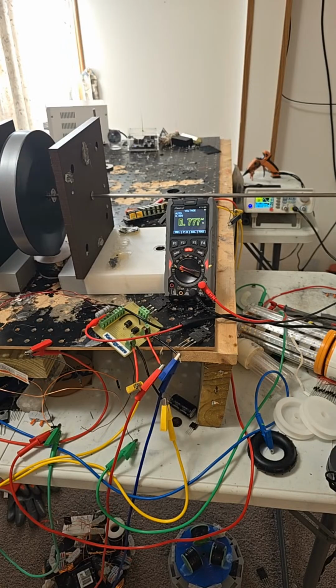All right. So, to set up the closed loop system, I think this wheel will work for it. Whatever we do, the wheel will work fine. With this coil at voltage, you want it to be between zero point three and zero point one amps, so between 300 and 100 milliamps. That's what you want. Yeah, that's what we got. So that's awesome.